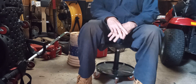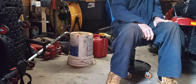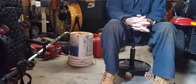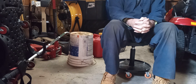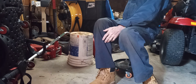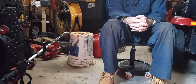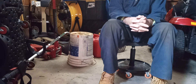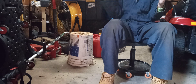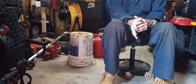I've got to get the flywheel and the chipper's shroud cleaned up — mainly the flywheel — and sharpen the blades. Then order the engine, get it in, take the old one off, and do measurements. The hub on the chipper shredder flywheel is two and five-eighths of an inch deep. That's another measurement you have to take, because you've got to make sure that your flywheel is going to stick out far enough to bolt to it and be in its proper spot, especially when you're feeding limbs to the main limb chute.